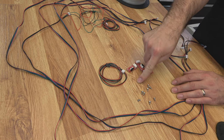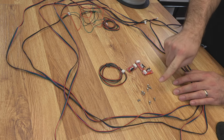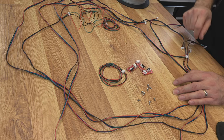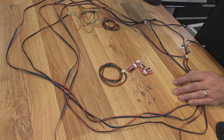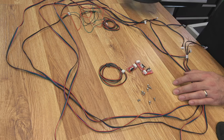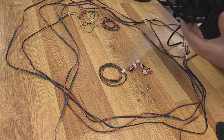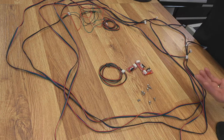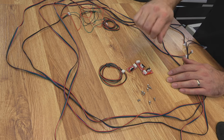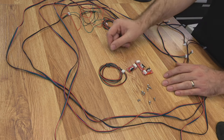All the PCBs are going to need an M3 x 6mm screw. I tried to work in a 10mm to keep it standard, but they're just too long, so you're going to have to have eight of those. For wire management, I'm going to use some 3mm nylon filament, just like the old school printers, with some spiral wire wrap. This works really well for X, Y, and Z — it's just to add some strain relief so you're not bending that wire over and over. I have some spots where we're going to zip tie it down, so you will need a handful of zip ties.